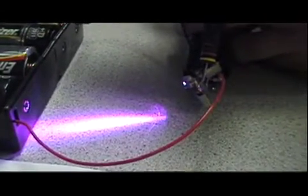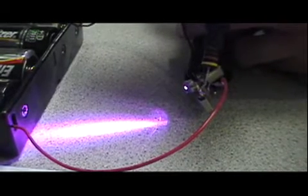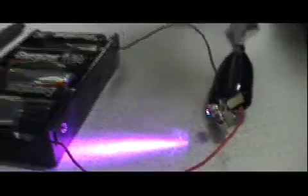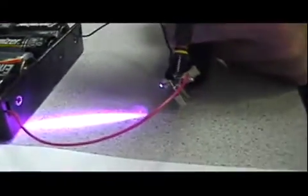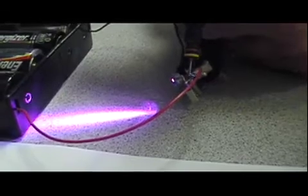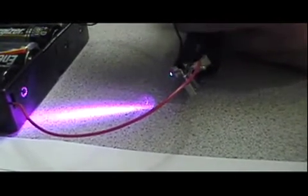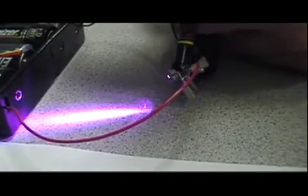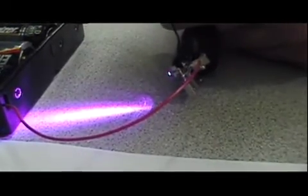You can see the spark is quite a bit brighter now, but still not even phasing that Blu-ray laser diode. So we'll set the instrument to give us 20 shots a second at 16 kV and see what happens. I'm putting 20 shots a second at 16 kV directly across that laser diode — of course, it's being protected by LASORB. And as you can see, it's just not even phasing that Blu-ray laser diode.